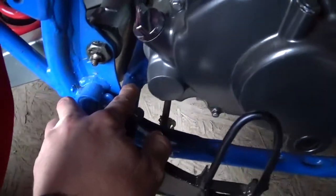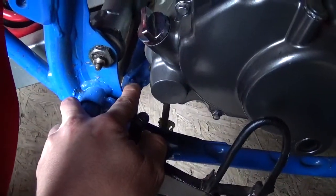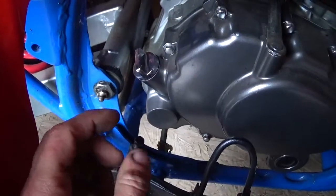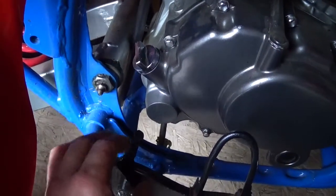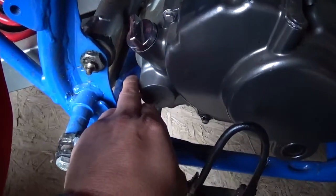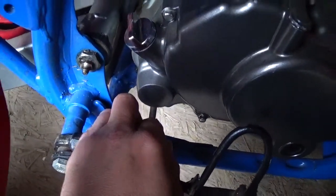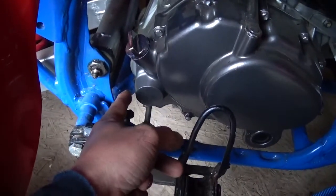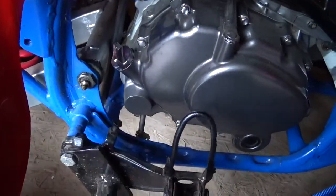The bottom ones here are box tubing — it's tubing shaped like a box. I slice down through the center of it and then kind of ground away things to try to make them look flat, so I can put a bolt on them too, so they've got a flat end.